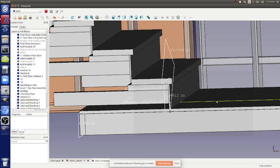Can we do 8 on a platform? 7.75 is the official stair maximum. I think so, because it's just another 4-inch platform that leads up to the platform. That's extra, though. You don't have room in front of the door, because the door is right there. So code is 7.75, we're at 8. Do platforms like that have specifications by code? Because that's not a stair, it's a platform. I have not seen it. In the code, they specify the width and length of landings, but I've not seen that they would specify that platform.